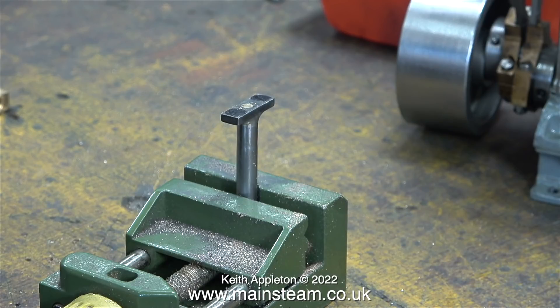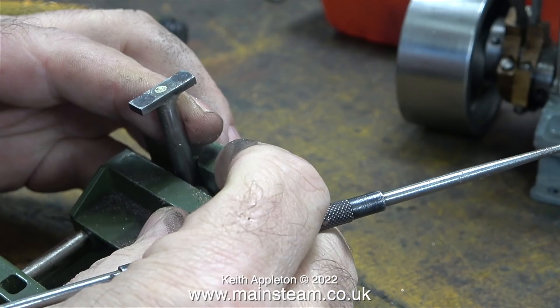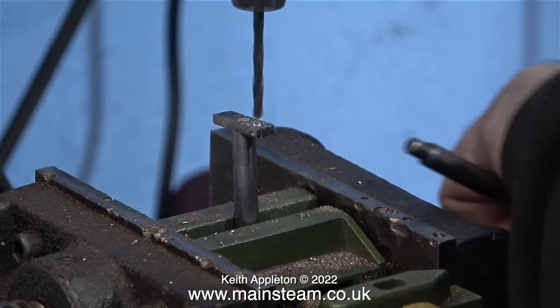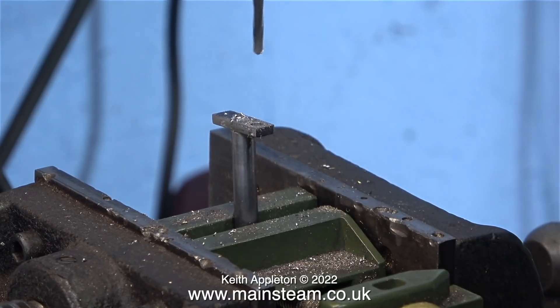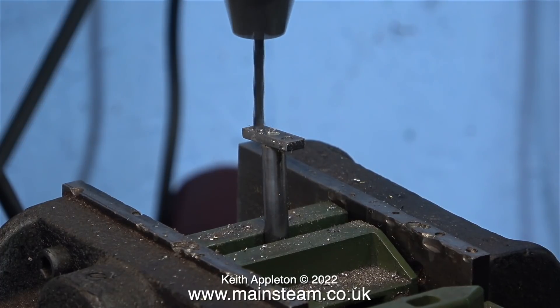The time has come to drill the holes in the new part of the bottom end of the connecting rod. Here I'm marking out the positions for the holes using my scriber, and the good news is when I look at the hole positions they are in the centre of the part. Using a centre drill to get the hole in the right position, I follow it through with a twist drill, then simply repeat the process to drill the hole in the other side — always starting with the centre drill so it doesn't wander about. In no time at all I ended up with two holes that were accurately drilled.